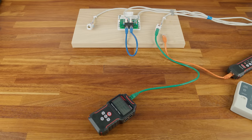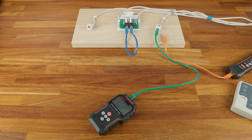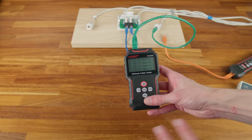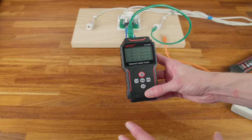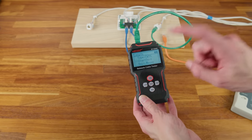Testing on our rig, a single run measures about 20 meters. Connecting an additional ~20m section through the patch panel gives a reading of 37.5 meters, confirming the full-length measurement works. While not perfectly accurate, this is super useful for identifying where a fault is in the middle of a cable, or for checking if a run is within the limits for things like 10-gig over Cat6 (around 35m) or HDBaseT Lite video distribution (also around 35m). It's good enough to tell you whether you're above or below those thresholds.